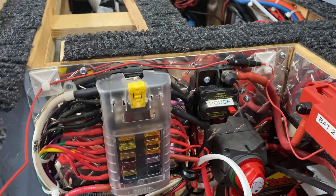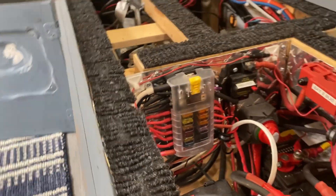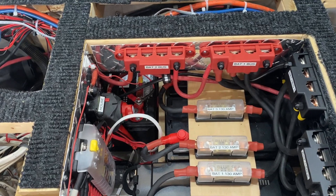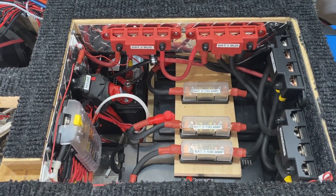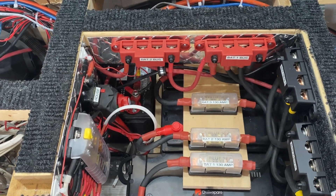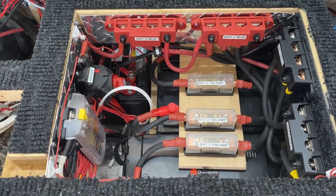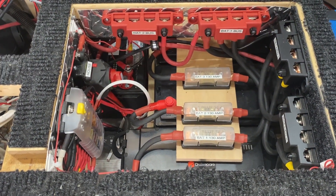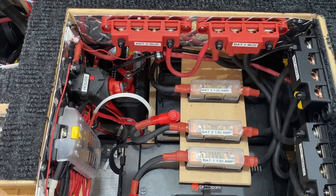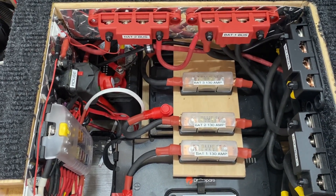There's a 100 amp breaker between the batteries and the Blue Systems DC panel. When I bought my Victron equipment from volts.ca, they gave me a complete diagram outlining how to hook all the equipment and batteries up. They suggested having a fuse between each battery and the main bus bar. At first I wasn't sure why, but if you have just one fuse between your battery bank and your inverter and your equipment, if that fuse goes, nothing else works.